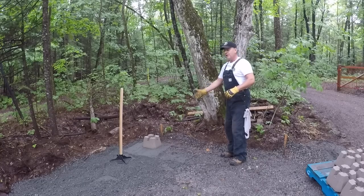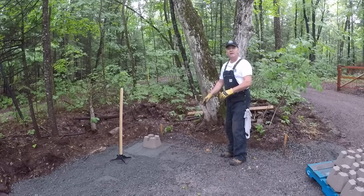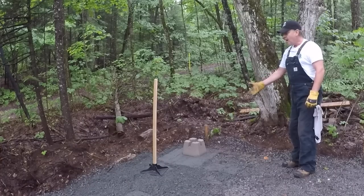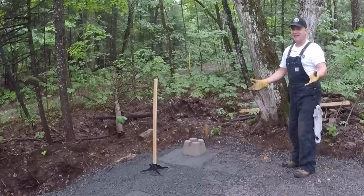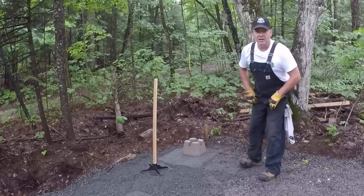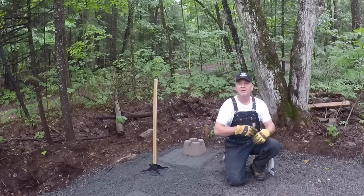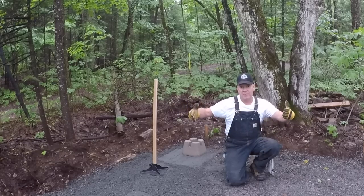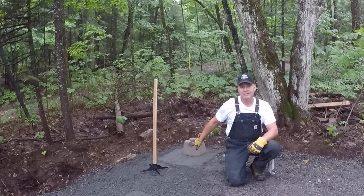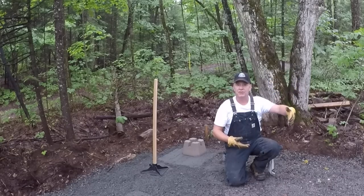So what I've done is I've just measured out 3 feet. I know that this seems to be the hardest or most level ground. So I've started with my first footing here, tamped the ground down, dropped my block, and of course, fortunately, it was level both ways. That wasn't on purpose, I think that was luck. So what I'm gonna do from here is take a look at where I want the shed to face. My property line is on an angle to my driveway. I know I need an inset from the driveway, which is why I've started in the very back corner here. And that way I know that the overhang on the front of the shed will be well back from the edge of the driveway.